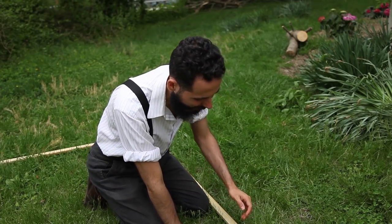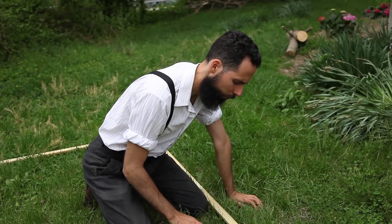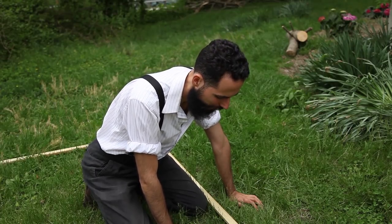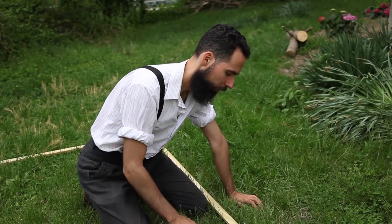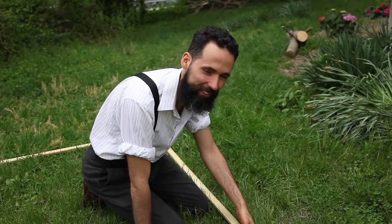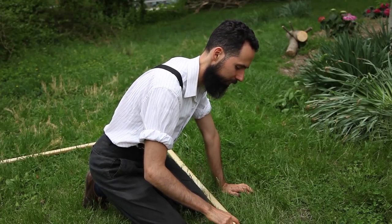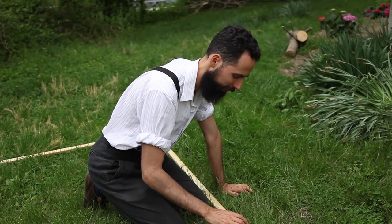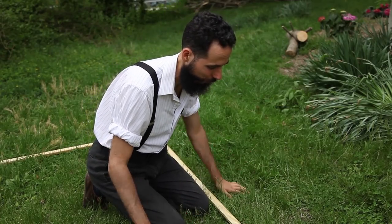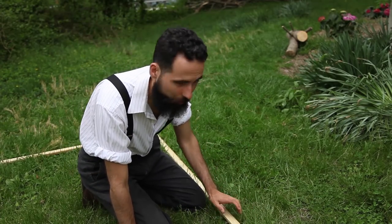Wood splitting like this is to be expected with thinner wood, so you can't really rush this. You will need to drill pilot holes. I know it's a little bit more work, not as easy and instantaneous to get things going, but it makes a huge difference. You can't have things splitting in half like this — you lose a lot of strength and it will come apart very quickly. So let's get a drill bit and drill pilot holes.